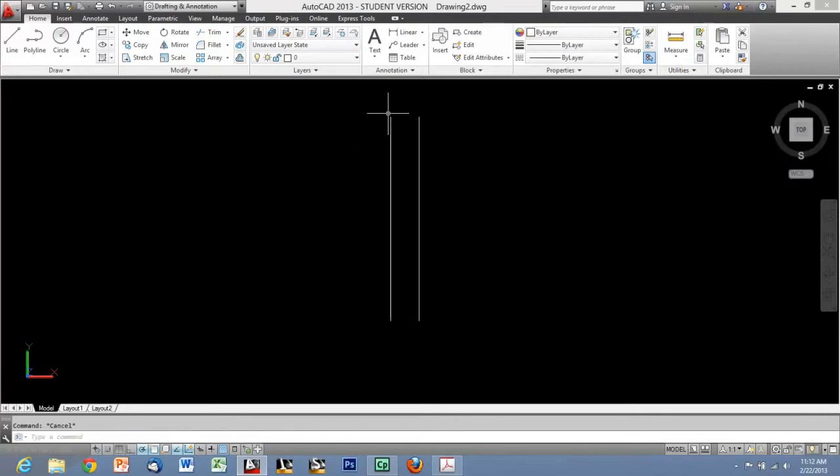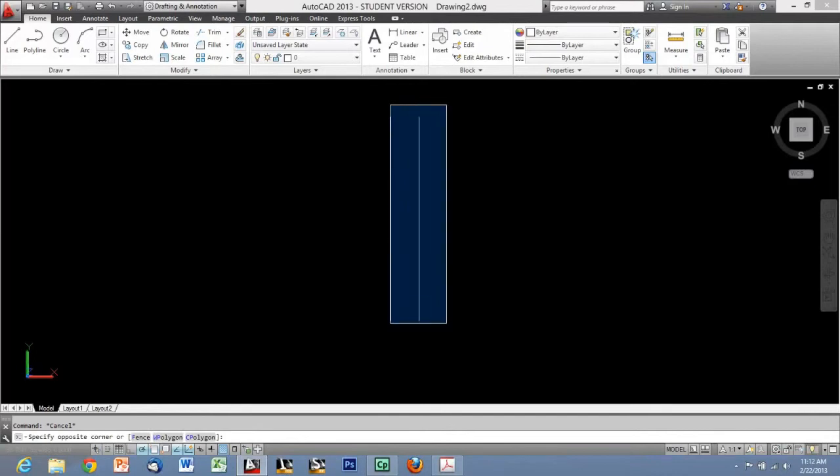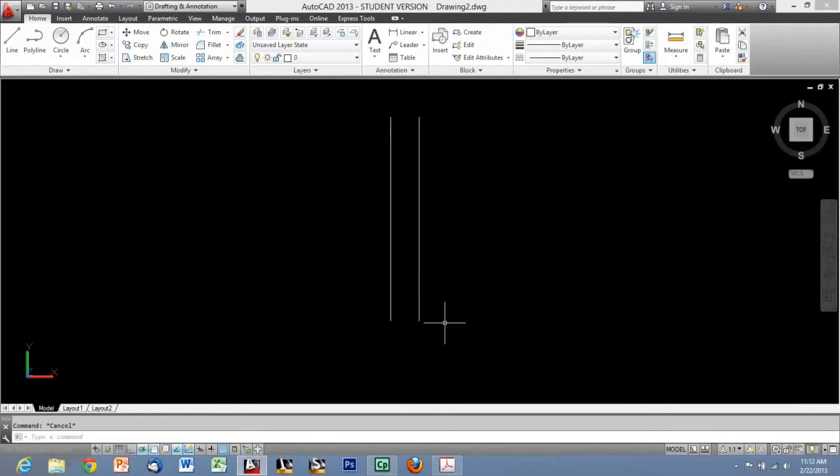And so this would actually be half of the center hole right here. The whole center hole for the pulley would come all the way over to here. And the next thing I'm going to do is offset that center line over 27 units to the left. So I'll go over 27, and then I'm actually going to connect these two from here to here. And then I'll take this same line and go down 20 units.